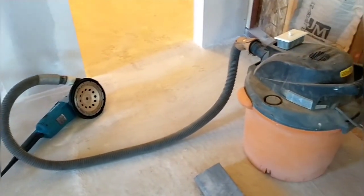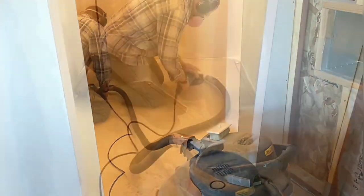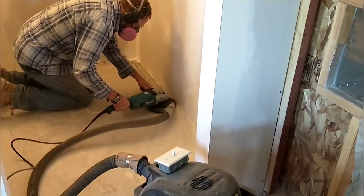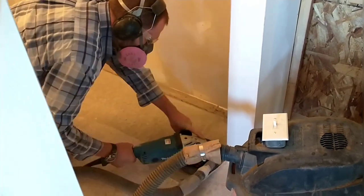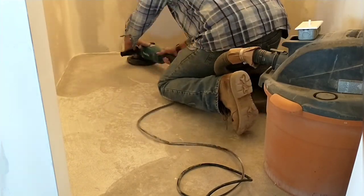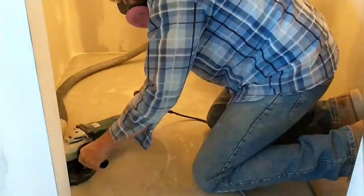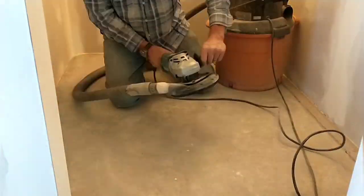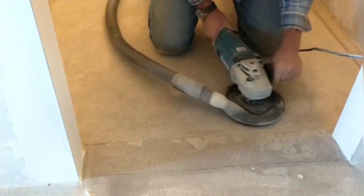One of the last steps to finishing the pantry is to finish the concrete floors. We're going to seal them rather than cover them. This was our first opportunity to test our method, so I bought a big disc sander — a nice Makita that was well-rated. It's taking care of dust really nicely, sucking up a lot of the drywall dust as it sands. Normally visibility would be nil without that vacuum hooked up. The Makita also had a lower RPM capability, which I liked — a lot of other big disc grinders were much faster, which isn't good. The slower speed gave me more control.